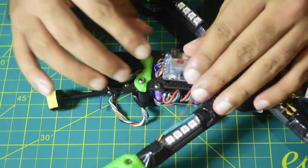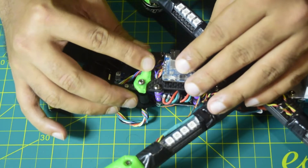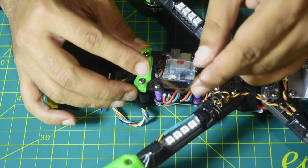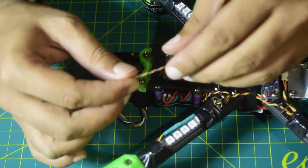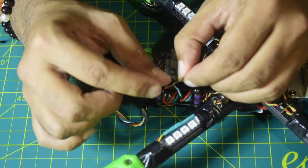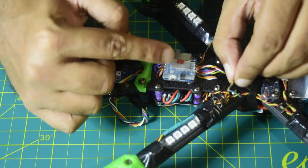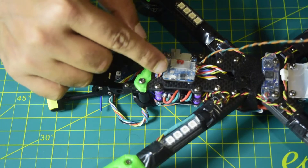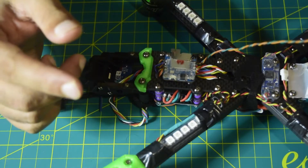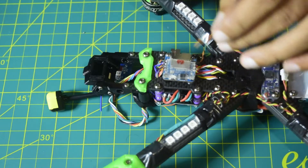Now let's quickly look at the drone and how I'm going to connect everything. As per the pin diagram I showed previously, I have a 5-volt out, ground, and an audio input. Here you can see the orange wire is going to be my plus 5-volt, the green wire is going to be my ground, and the brown wire is the audio input for my DVR. The wiring was already done in my previous video — I'll put the link above or in the description.